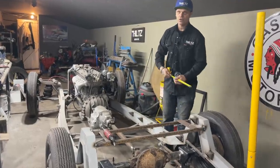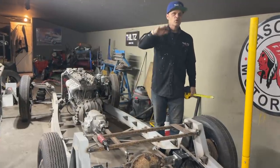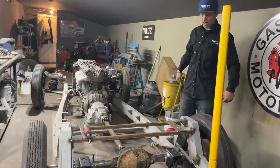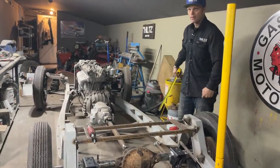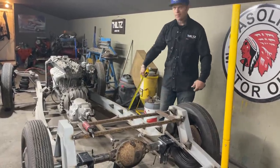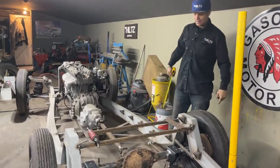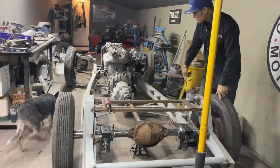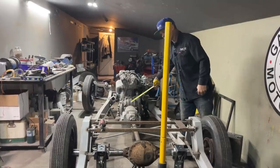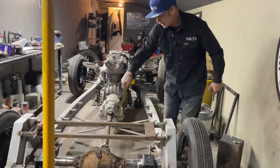Think of a tractor. When you have a snowblower, the universal joints are changing all the time when the snowblower goes up and down and is running. So you really have to take a few cars apart and understand that you're allowed to do that, and they do it all the time. If you're not underneath the car and see the drive shaft running crooked, you really wouldn't know. That's what the universal joints are for, to allow for that. And I have put engines in crooked because I know that it can work. It works because they do it with the rear end in cars all the time.